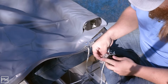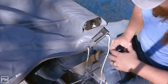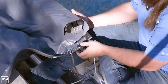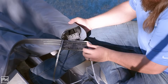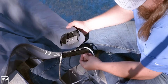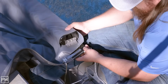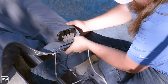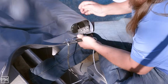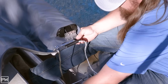Either one. Gonna take our screw and nut, make sure we set them somewhere where we know we're not gonna lose them. Get our leading edge insert put in, and again, remember on the bottom, we're gonna use the front hole here, that front countersunk hole, with our screw going up through the hole, on the slider, through the fabric, and then finally, through the center hole of our insert, just like that. I'm gonna get that nut on top.